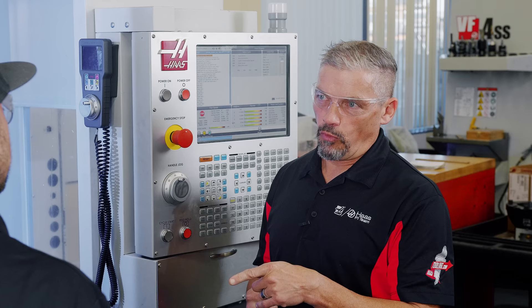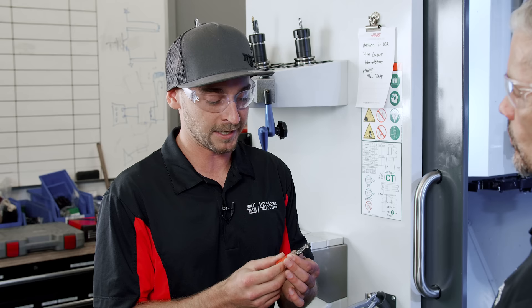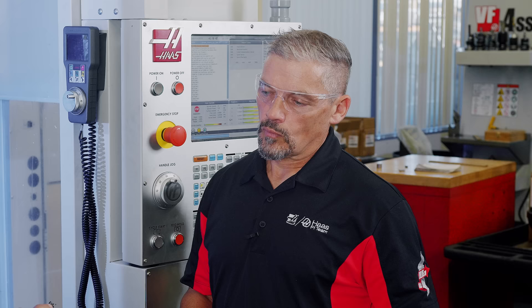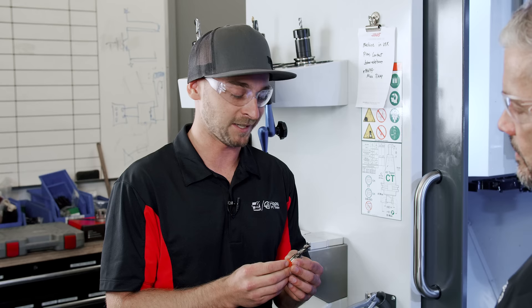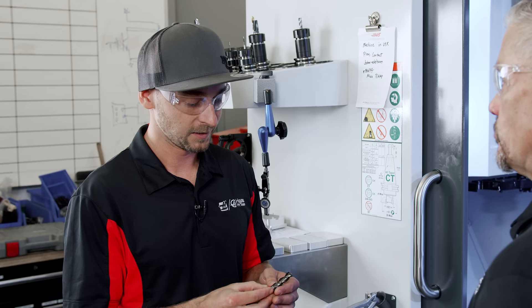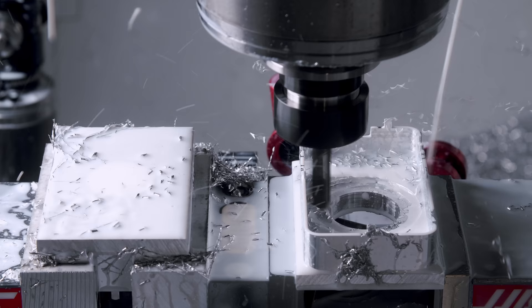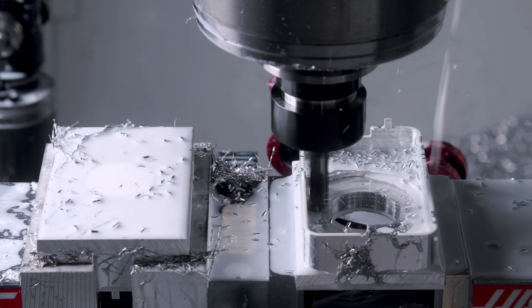The tooling is pretty straightforward — some end mills and a face mill. Pretty much using just a half, quarter, three-eighths, and a one-eighth end mill for roughing. My half-inch rougher is one of our DLC-coated end mills with chip splitters, which lets me get rid of that material a little quicker. The chip splitters make even smaller chips, so combined with the drain hole, it all just washes out. I've pegged the machine at 10K no matter what — but chip load I'd normally run around three to three-and-a-half thou with a polished end mill; with this DLC-coated one I'm running at six thou. Why not?